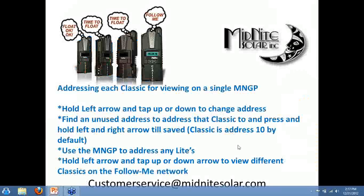You do need to use the MNGP to activate Follow Me on the Classic Lights — at this time Follow Me cannot be activated over the local application software. Also note that Classic Lights with serial number 5,400 and below: the MNLP (Midnight LED Panel) will not work with Follow Me. If you have one of those older units and want to use Follow Me, please email me at ryan@midnightsolar.com or customerservice@midnightsolar.com and I'll get you a replacement MNLP — there was a code change to support Follow Me.